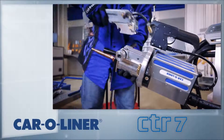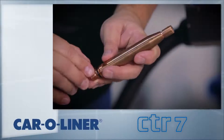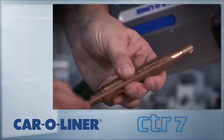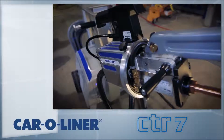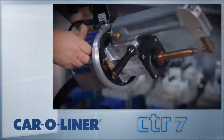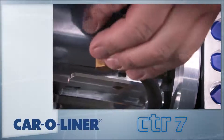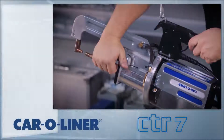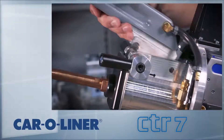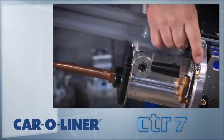Refer to the chart on the electrode box for assistance. Each electrode cap holder is stamped with a number for easy reference. When installing the electrode, apply a small amount of the copper grease supplied with the welder to the threads. Always make sure that the beveled edge of the cooling tube is inserted first. To change the C-arm, hang the gun on the welder and hit the coolant button to turn off the pump. Loosen the locking handle on the swivel ring and rotate the gun so the arm is facing up. Disconnect the cooling hoses. Unlatch the retaining clip from the hinge pin by sliding it up. Turn the locking handle 180 degrees. Lift the C-arm and pull it out from the front of the gun. To reinstall, insert at a 30-degree angle until it reaches the hinge pin, then rock the arm down into place. Turn the locking handle, making sure it is tight, and reconnect the hoses.